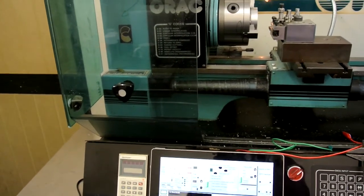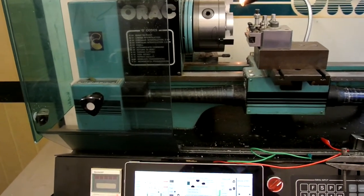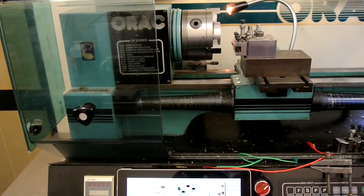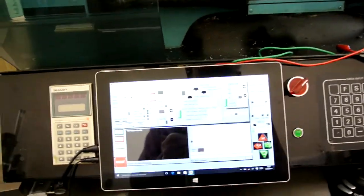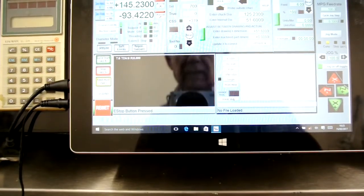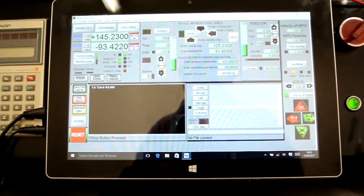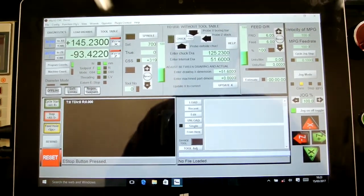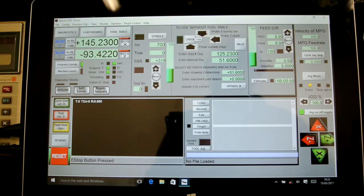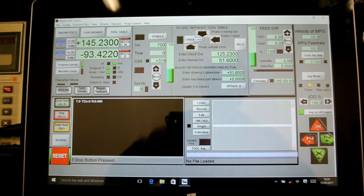All I had to do then was think about whether to run it on a laptop. I tried it on a Windows 8 laptop and it ran fine, and then I thought why not try running it on a tablet? I bought an extremely cheap Lynx 10-inch screen tablet, which is just what I have here, and have been frankly astonished that it will work on it. It's running Windows 10. I've had to shut off all of the updating programs, and apart from having to load Windows .NET 2.0 and some updated drivers, really didn't have to do very much else.